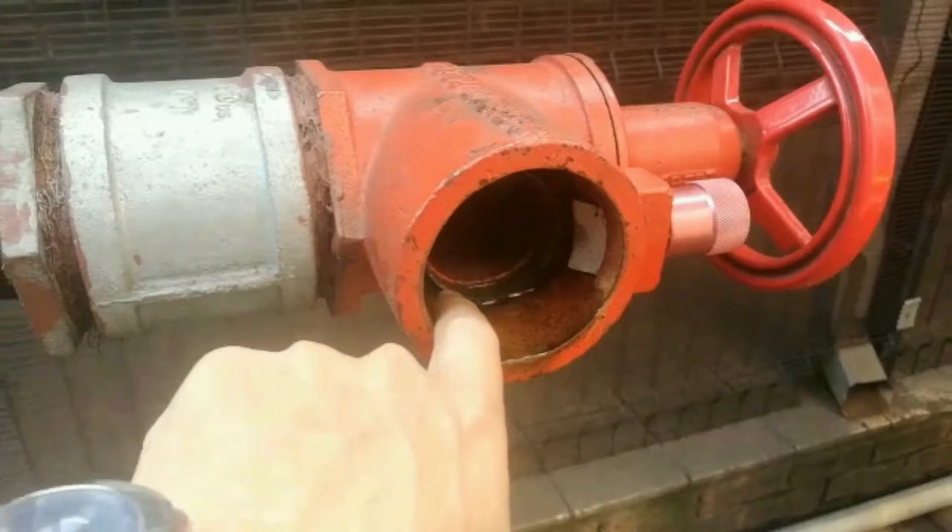The Morris washer has to be there, otherwise your hose will leak exactly where it connects into the hydrant — and it won't leak a little, you'll all be wet. Once you've completed all these checks, then you can connect your hose to the hydrant. It's a quick inspection that you have to do every time before you connect a hose to the hydrant.